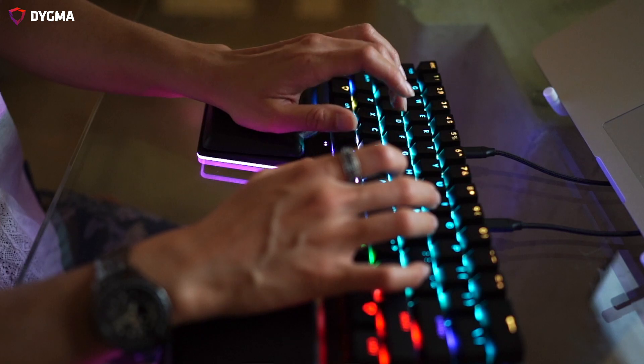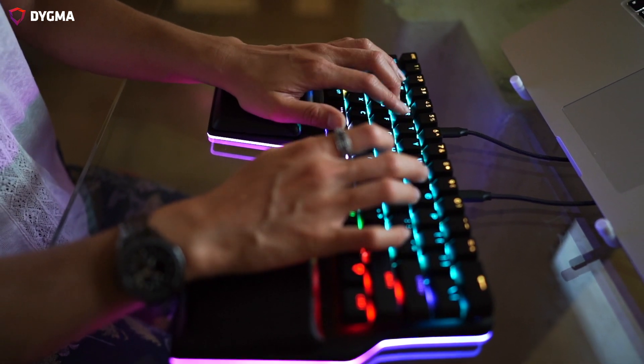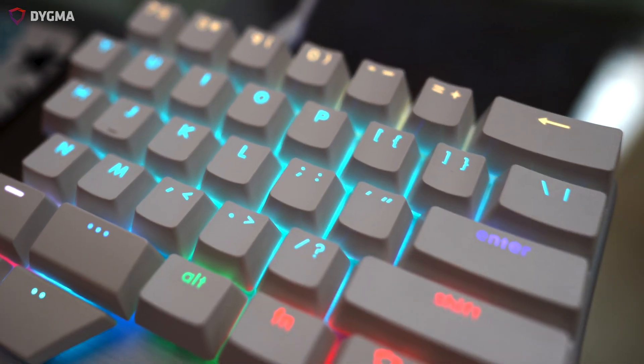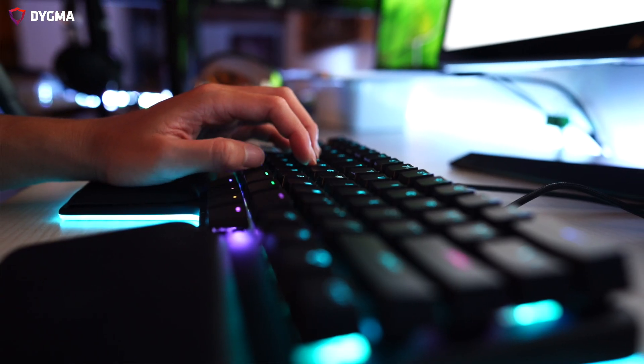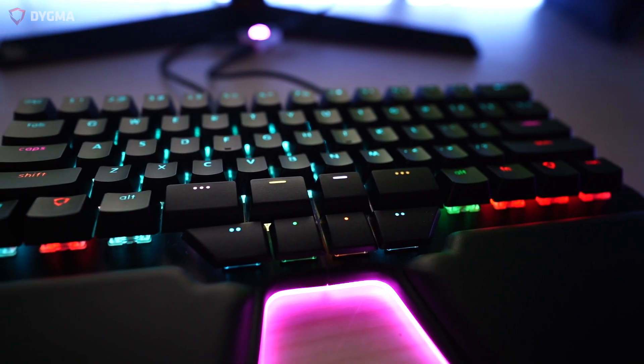Finding the correct dimensions and locations for those keys was tricky, especially if you want to maintain good ergonomics and comfort. For example, every finger but the thumb taps the keys with its fingertips, so the keycaps were designed to be pressed with the fingertips. That's why they have that slight curve in the middle and have different slopes. The thumb taps the keys on its side, so we reversed the slope of the spacebar to fit the movements of our thumbs.